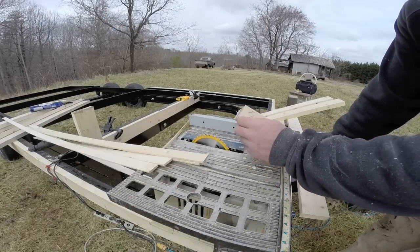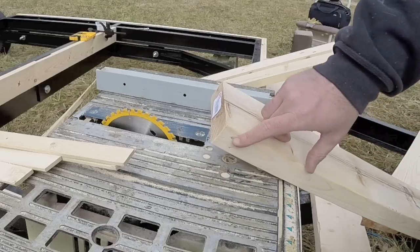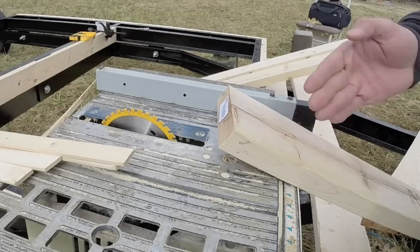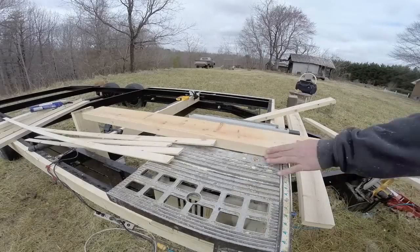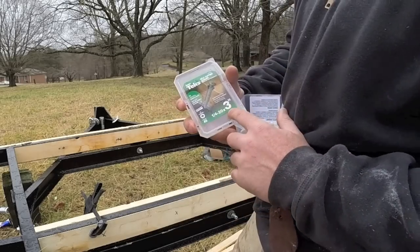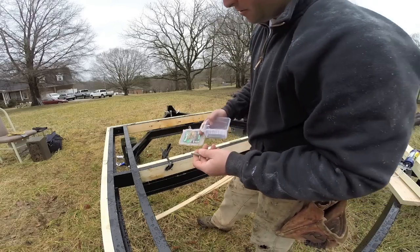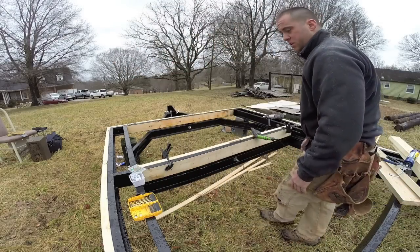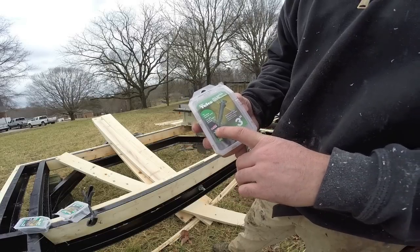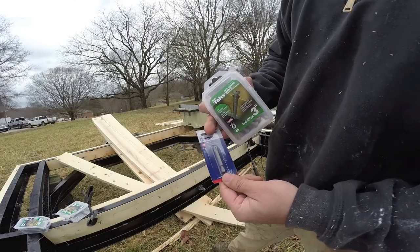Sometimes boards have staples in them — it's best to take them out so they don't dull your blade. Also if you were to put this against the fence it's going to push the board off almost an eighth of an inch, which will throw off your number. The reason I went with five and an eighth is because over time boards will shrink and I didn't want the steel to make the floor uneven. The screws I'm using are self-tapping screws — they should go through the metal but from my experience they don't. So I'm pre-drilling with a three-sixteenths bit a little bit. On the box of screws it's going to tell you what size Phillips head you need, which is a number three — I made sure I got a number three driver.